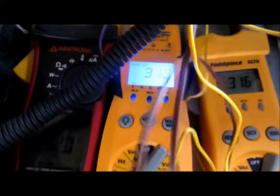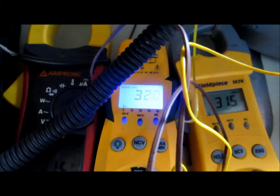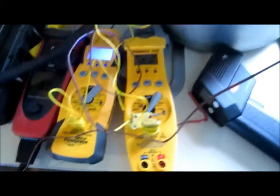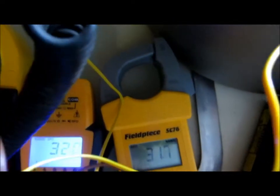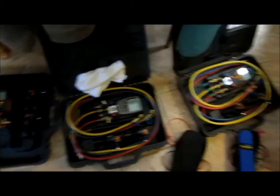I like the backlight on the 36, but to be honest, the 36 is a true RMS meter and it's got a delay on the reading. When you're checking voltage and put your probes on there, there's like a five-second delay before you get the proper voltage reading. I don't really trust it — I want to put my probes on and immediately see if there's 240 volts there. Overall, I'm very impressed with the accuracy of all this stuff. The only one I had a problem with is that one probe. Next I'm going to get my Testos all set up and see what we've got — should be interesting.